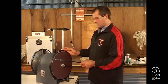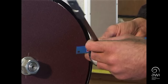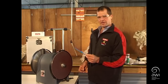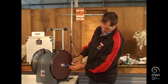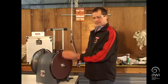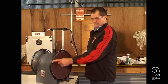We're nearly ready to grind. The next thing is to get the height right — it's exactly the same as the comb side. We've got to set the radius line to the middle of the hole where we finish off grinding, adjusting that line with the pendulum approximately 25mm from the outside edge of the disc. Now we come to grind. Make sure the paper's tight with no bubbles and no bits or chunks hanging off the edge of the paper.